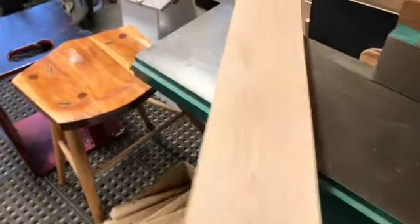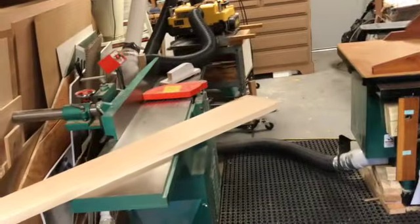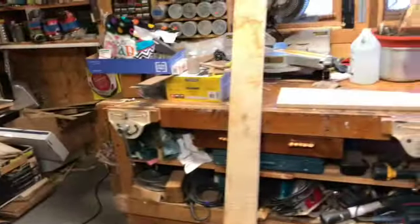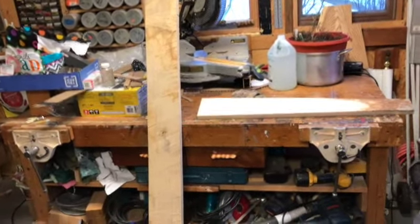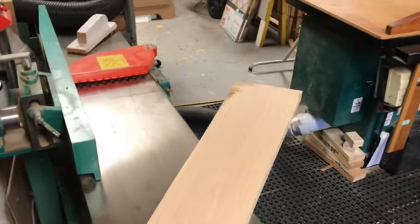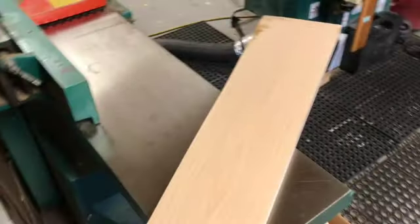However, once I got into the wood, I discovered that the moisture content is still around 13 to 14%. So this is going back in the kiln, but at least I've started dimensioning it so that I'll be able to use it shortly. Alrighty, I'm a little bummed out, but such is life. I did hear and read about how difficult it is to dry oak, and I can see why. It really wants to check all the way through. So we'll see what happens with this in time.